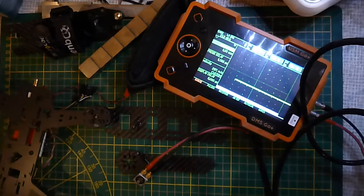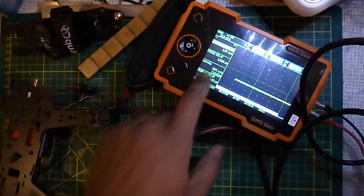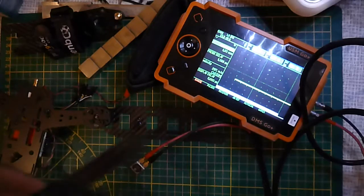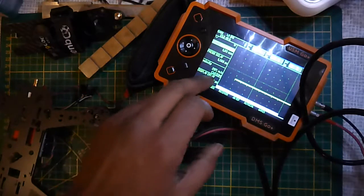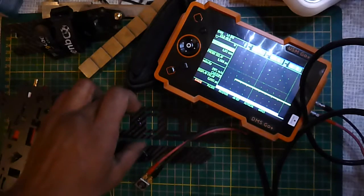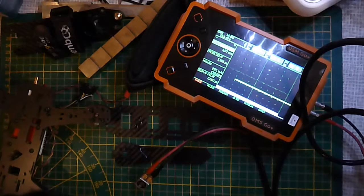With this probe delay, you can read it from the screen, and after establishing my probe delay, I changed my sound velocity on this 4 millimeter piece until it hit 4 millimeter in this display. Then I tested it on the 2 millimeter piece, if it would jump to 2 millimeters, and it kinda did. It jumped to 2.11. Normal people say 11. And yeah, it was good enough for me.